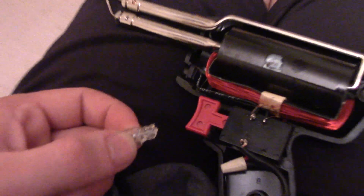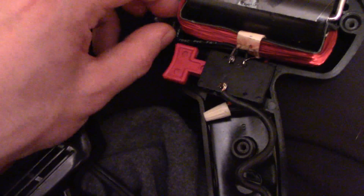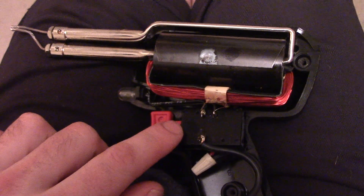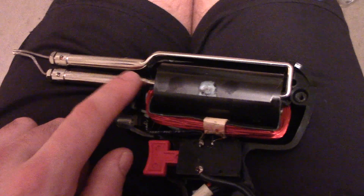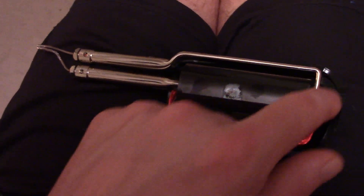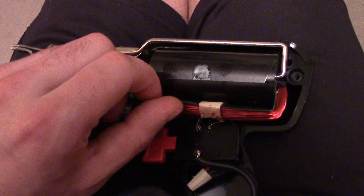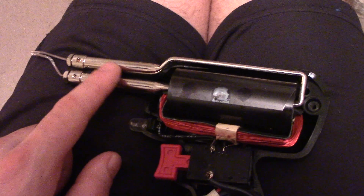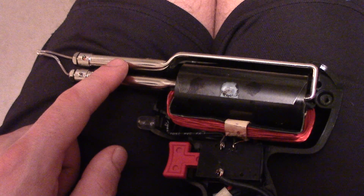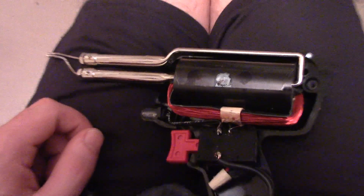You can tell you have a gun from the 60s or earlier if it has a screw-type base bulb. The secondary is very thick and I believe made of nickel rather than chrome based on its heat resistance. The thin primary winding induces a high amperage, low voltage on the secondary. You can even lick your fingers — it's not going to shock you, you won't feel it — but the amperage is high enough that the tip will heat very quickly so that you can solder.